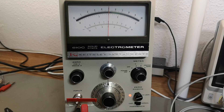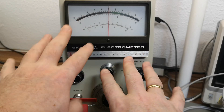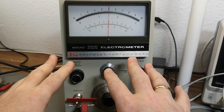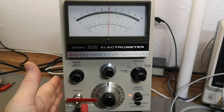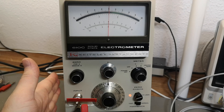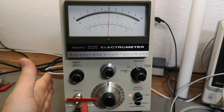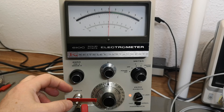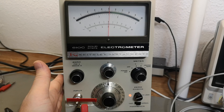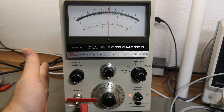That is crazy. I don't think I can find any resistors higher than one gigaohm to prove what would happen further. But I can do the hocus pocus - especially near this input. If I move slowly, nothing happens. But if I move fast, you can see this is the charge coupled from my fingers. If I go closer, I raise the voltage. Isn't that a little bit crazy?